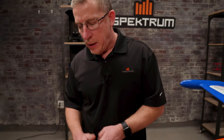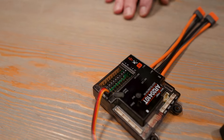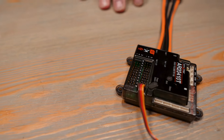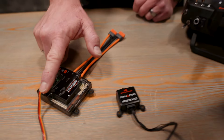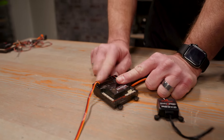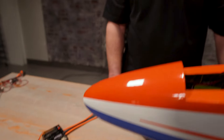Another thing that can be a little confusing: the first row on the receiver is your switch and your first 10 channels, and there's a sticker on the side for channels 11 through 20. Also note that this is a new switch with a single lead — the light is built into it. It is not a latching switch; it's a momentary switch. Please use that switch or the button on the receiver itself. Do not use any previous switches — they are not compatible.